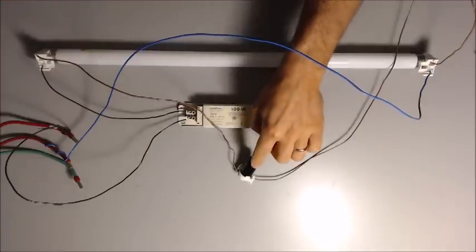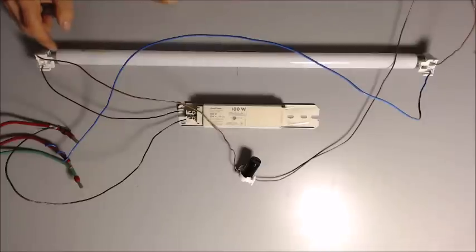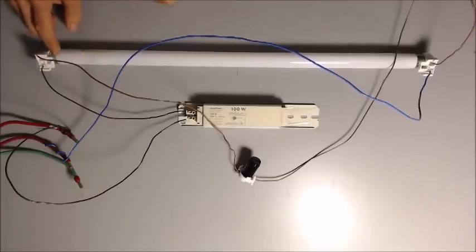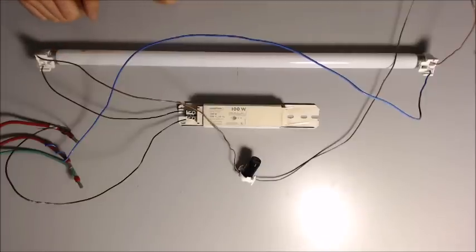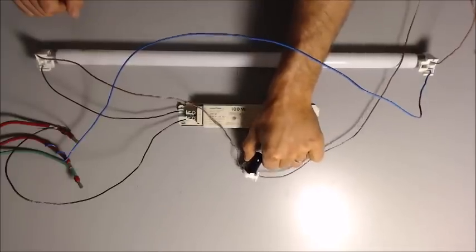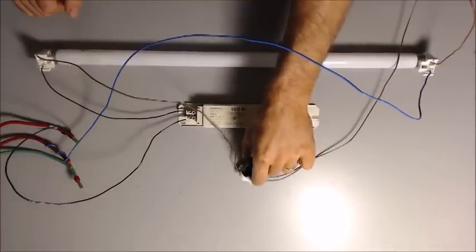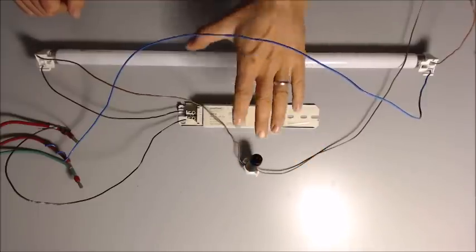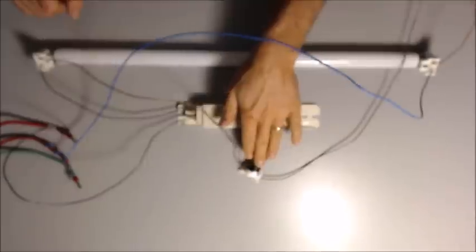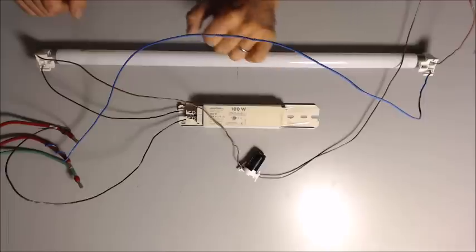And the moment that that disconnects, that also means that there is no connection from one side to the other for an easy connection through the cathodes, and they're going to stop glowing. So if you have a strong glow and the lamp never starts, you can have a bad lamp, but most likely you're looking at a bad starter. Which also brings me to that it's important that you change your starters accordingly. For big VHO bulbs of 160 watts, I'll say at this point, because the quality is not what it used to be, replace these every time, every relamp. And for 100 watt, 120, every second time.